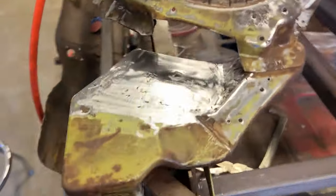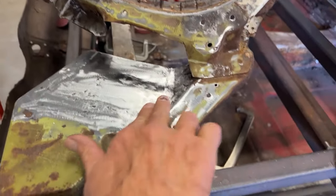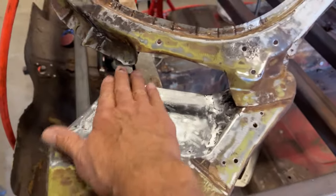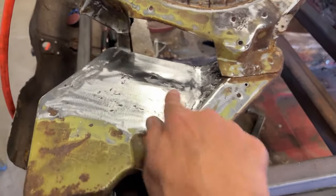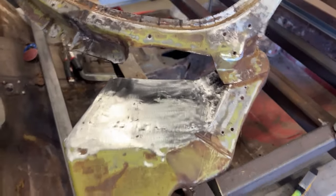As you can see, I got all the welds blended in. There are a few little crevices I could go back and fill with weld and grind again, but I don't want to thin this metal out any more than I have to - the spot welds were nice and solid. So I think I'll just prime that and paint it.